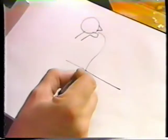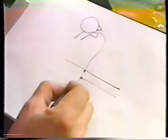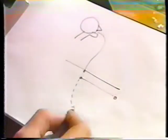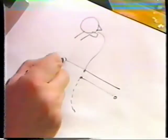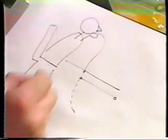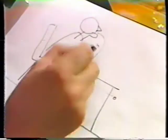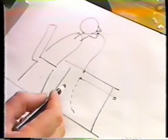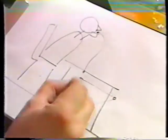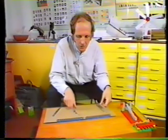And in order to get this sort of curve, we can have an extra little arm from there. And the path of this arm, swivelling around that point there, will produce a curve a bit like that. So what we have to do really is, when we've got the two parts made, we can then move this in and out so that this final point of that coincides with the jaw. And this lever that controls that will be fixed between the legs of the table if it's planned out carefully. The problem is to decide on the length of that lever and where to pivot it.